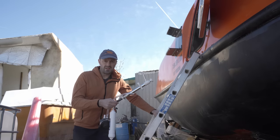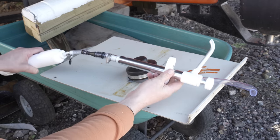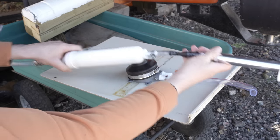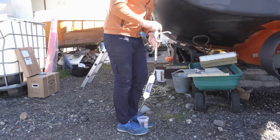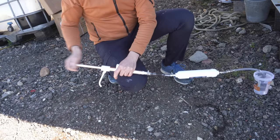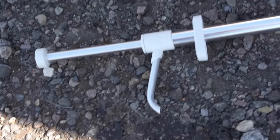Right, we'll see if this works. This is the whale foot pump that couldn't generate enough forward pressure last time round to drive our precious water up, up, up and away. So I decided to try a hand pump which draws and drives water on both up and down movements, also from whale. I tried it with about a meter of rise to manage, and no good. Then I tried horizontal with no gravity to fight at all. Not really any good either. There's water flow, but it's a dribble.